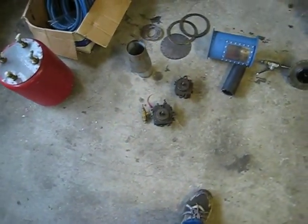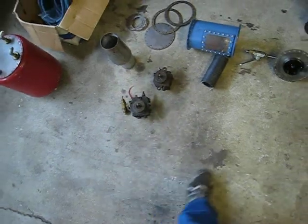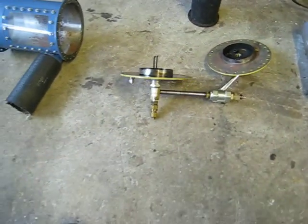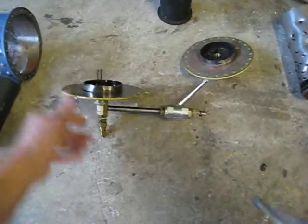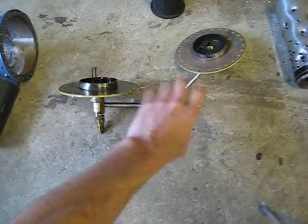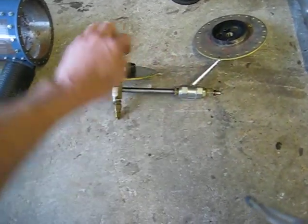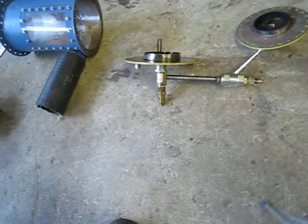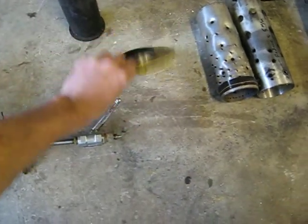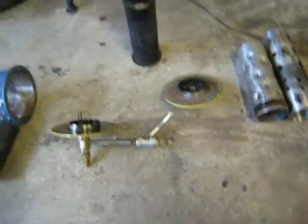For that, I have this vaporizer right here, some extra hose, and a couple of pumps from an experiment with liquid fuel. There's a smaller air jacket, and this is one of the Hago bypass nozzles — this worked out really well for liquid fuel. You pump your fuel in here, then start restricting the bypass, and as you close it off, it forces the fuel out the nozzle, giving an awesome spray pattern across all different fuel deliveries.